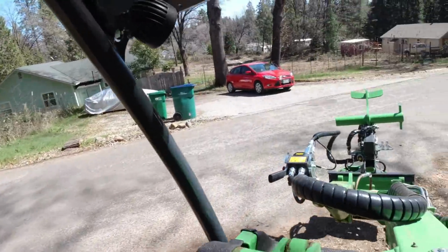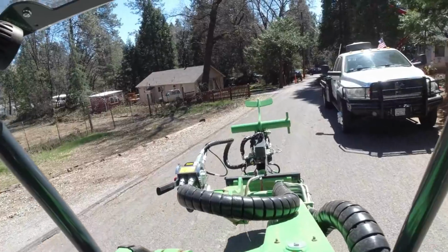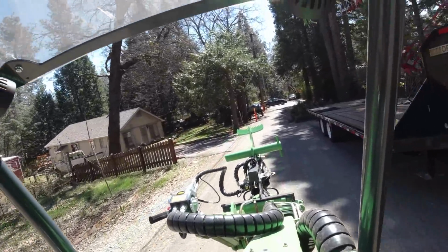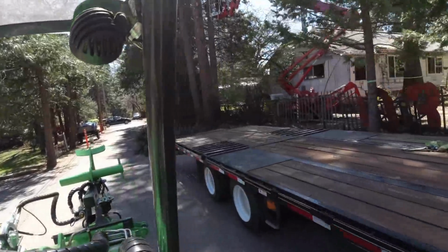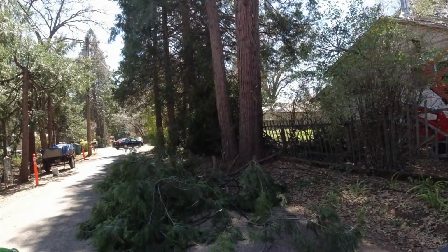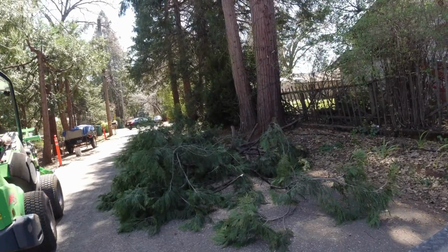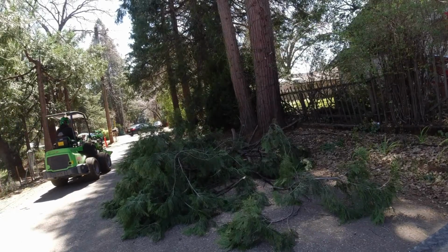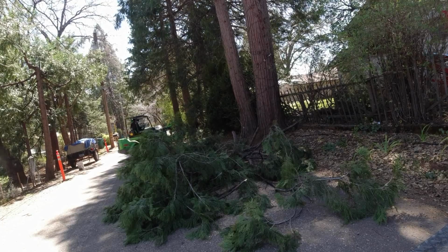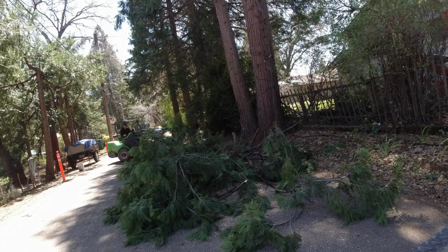The Avant series has a little bit different quick coupler on the front, but they have a nice hydraulic mechanism so you can swap it over real quick. We just had the brush rake on there with a hydraulic grapple on it, and switched it over to the rotating log grapple. This one actually has a secondary function already plumbed in, so that when you snap it up on there, electronics and everything are in effect. If you want to rotate the grapple, it already has it all plumbed in. So it's super, super easy.